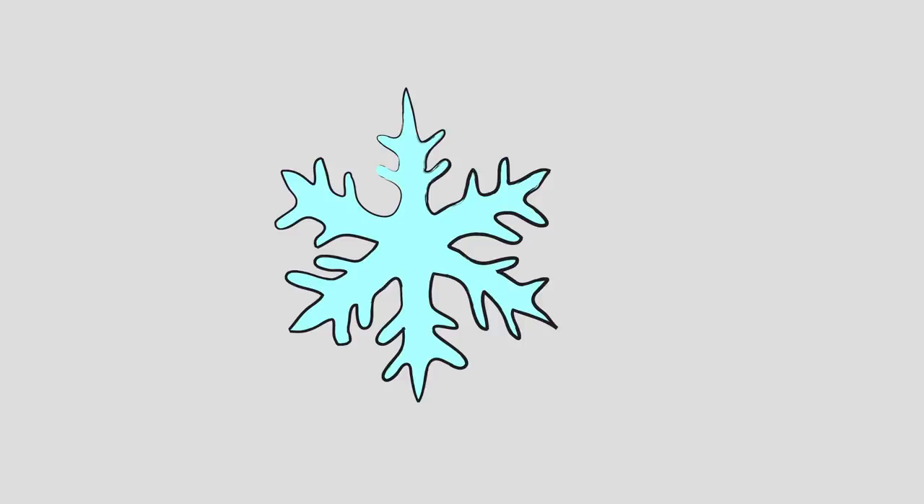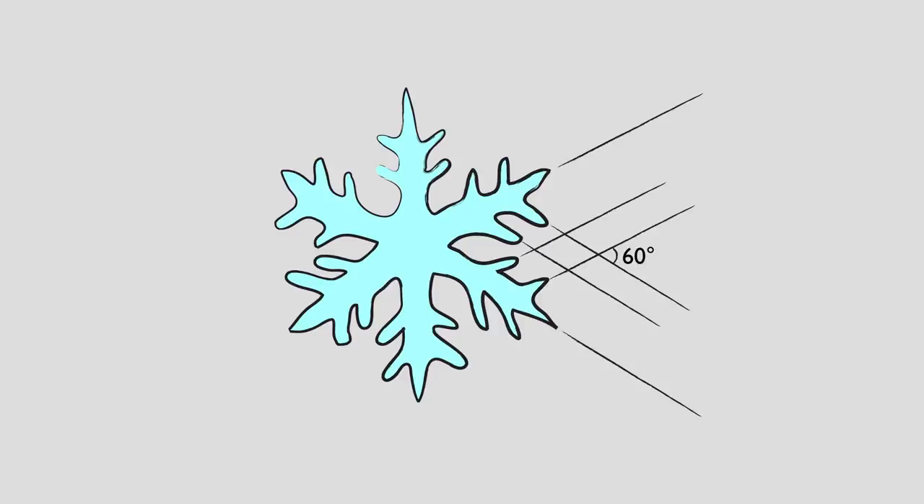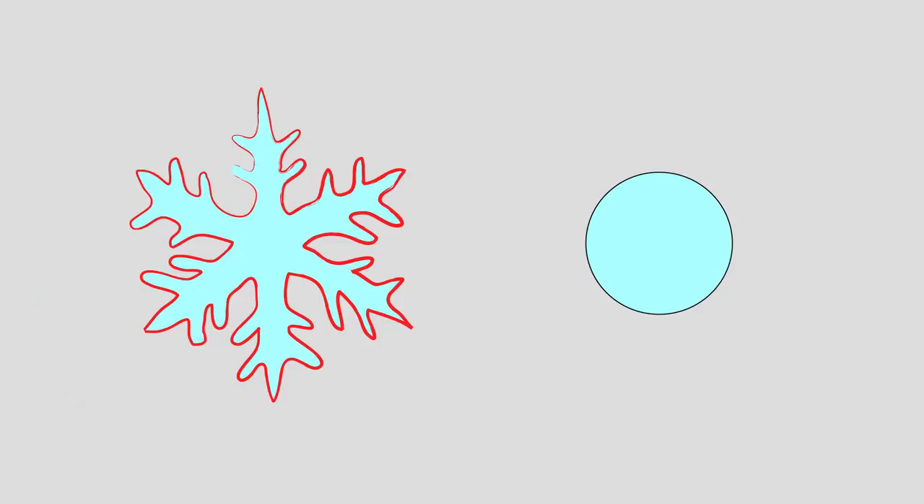This was my first evidence that this sound was linked to a physical mechanism called dendritic growth or dendritic solidification. The classic snowflake shape with the six-pointed star is based on crystallography — the ice crystal has six-fold hexagonal symmetry, but it doesn't actually want to make this crazy star shape. This has way too many free surfaces, and surfaces cost energy. Every material is always trying to reduce its energy by assembling itself into a more stable configuration. In a perfect world, everything would crunch down into spheres because spheres have the best surface area to volume ratio.